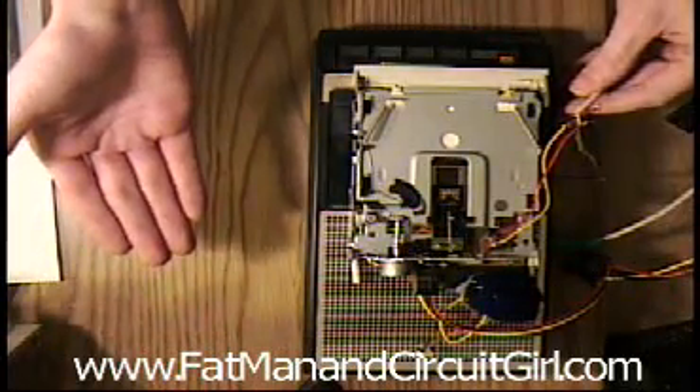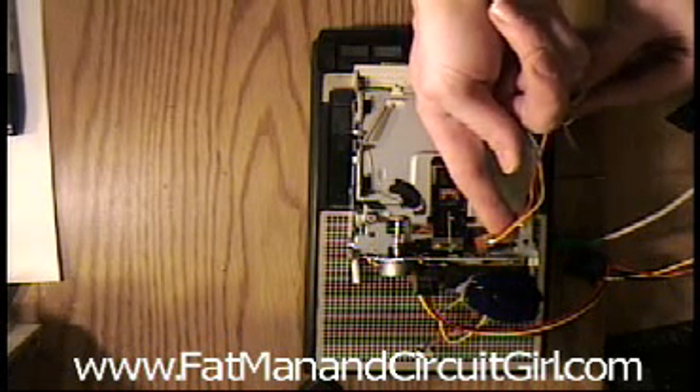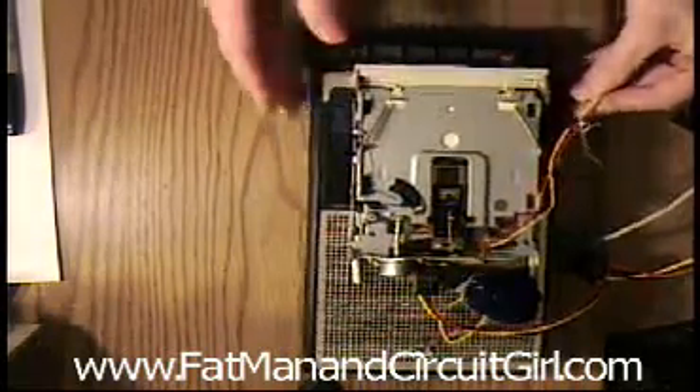From the edge connector you can't pass true analog signals, so I actually had to remove the flex circuit cable and solder a couple of wires so it actually talks to the head.